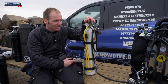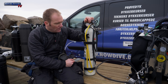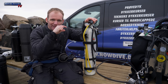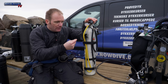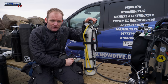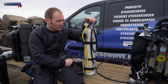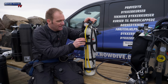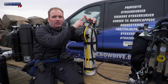In my experience, it's very rare that they bubble below 8-9 bar. And it's a very easy test. All dive shops and dive centers have these small intermediate pressure gauges, and if you want to invest in your own, they're very cheap. So you can just hook that up usually to a normal low pressure inflator, like you put on your BCD or your dry suit, so you can test it. So anyways, be careful when you use these free flow savers. And if you want one of these, you have to put one of OPVs on your first stage.